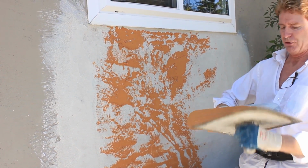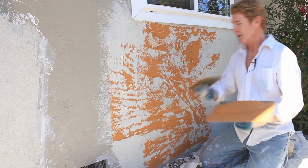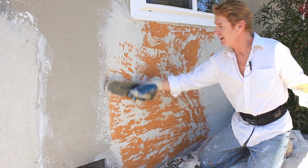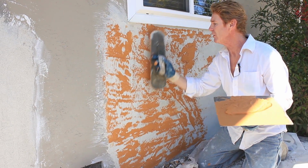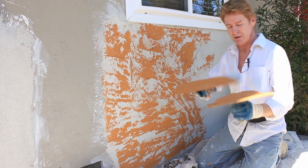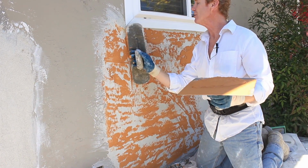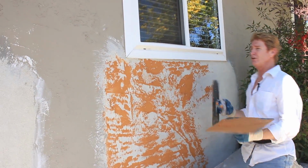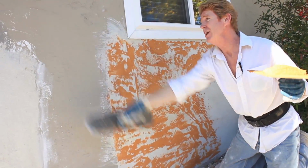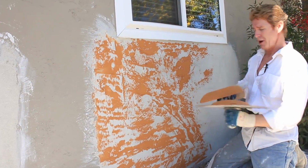Where it comes to this transition here, notice now, I built that out a little bit more just right here. This is about the thickest transition on it, where I had to feather in. In one spot there's 1/8 of an inch, and another there's about a 1/2 inch. I would get that just about there. And again, I look at that texture, which I can see a patch here, but this is the texture we want to match. Two things going on this house.